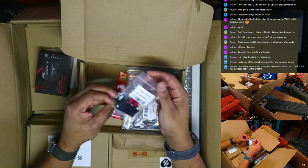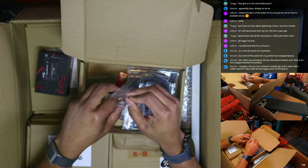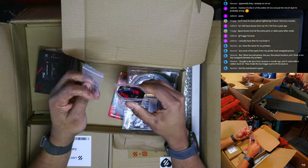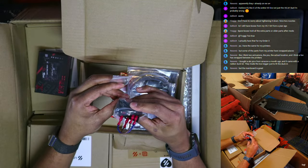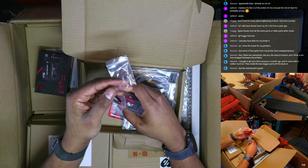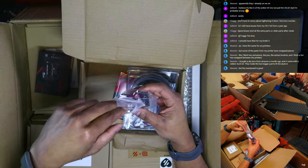We've got the pre-wired power inlet. Playing with mains voltage or wiring up mains voltage is always a little bit of a worrisome thing, especially if it's your first build. But it looks like it has everything on here except for the earth ground. And then it comes with two fuses. I'm not sure if there's already a fuse in there, but extra fuses are always nice to see.